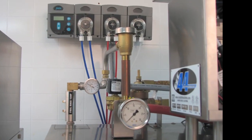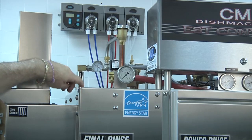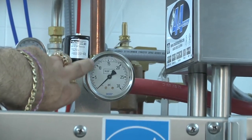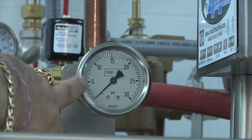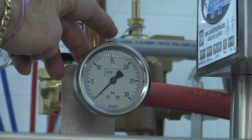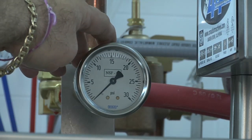While the final rinse is running, if you don't have the proper pressure setting already done for your machine, simply adjust the pressure regulator located on the plumbing system for the final rinse. Remember, when adjusting the pressure for the final rinse, it needs to be set between 20 and 23 PSI for optimum final rinse pressure. You'll notice inside the gauge there is an air pocket at the top — the fluid inside this gauge is not water, it is an oil which stabilizes your measurement. If you've received a unit that has a larger air bubble than required, simply while the rinse is running, lift up the little yellow flag and allow the air bubble to vent. Once you've removed as much air as you want, remember to return it to the down position. This piece cannot be removed from the gauge or you will evacuate all of the oil and will have to replace the gauge.